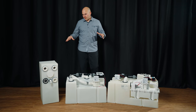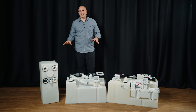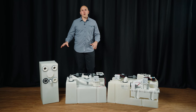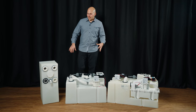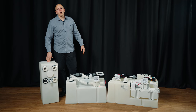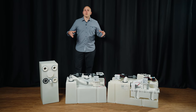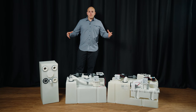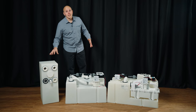Our favorite is long-chain polyethylene rotationally molded tanks. All of Dometic's holding tanks have what's called a 3/8 inch nominal thickness, meaning the minimal thickness of any part of the tank is 3/8 inch. They have a round mold that's filled with liquid plastic — the mold rotates and is spun, and that's how they mold these tanks.